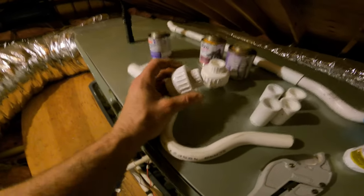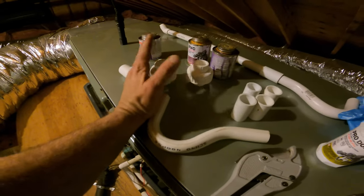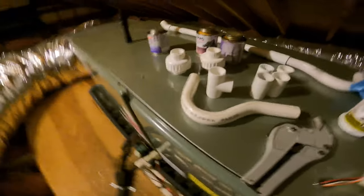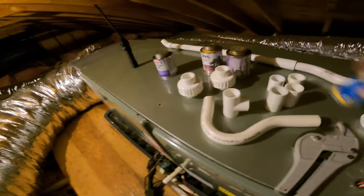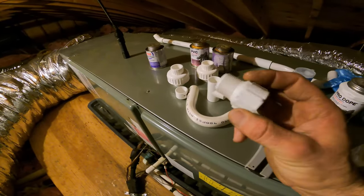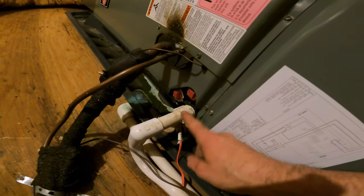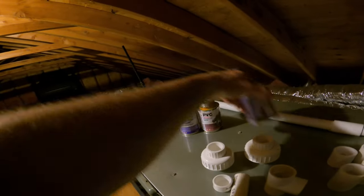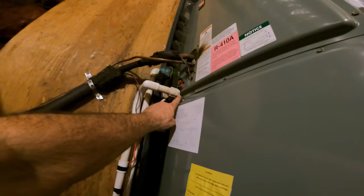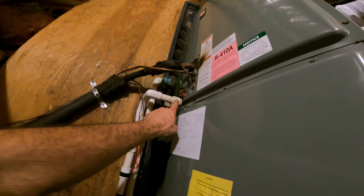What you're gonna need is a P-trap, couplings or unions — either one. I like unions because you can take them apart after they're glued if you ever want to remove and clean it, even though once you do this the trap should never have to be removed. You'll also need a T so you can build your clean-out, a cap, and a male or female adapter depending on your unit's connection. You'll need primer, PVC glue, and you can optionally put a little pipe sealant on the threads — though since there's no pressure it usually never leaks. Hand tight only.